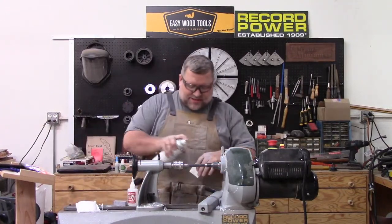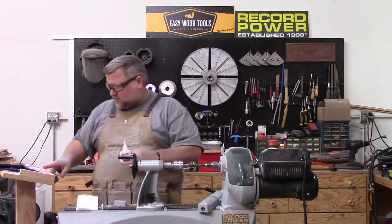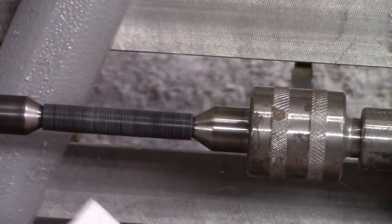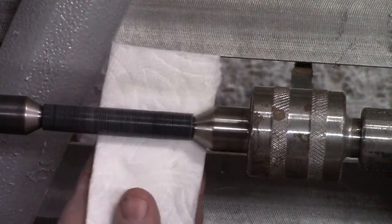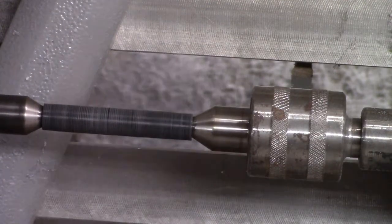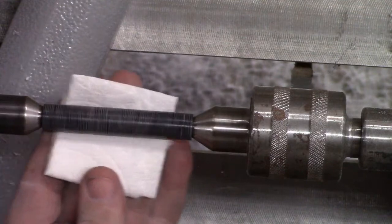Now that's already hard because I did have some residual accelerator. Oh, thank you, sir. But I can use this next part of the towel because I've only hardened the bottom part here. So I'm just going on and across. And that's it. When I'm done applying four or five coats, I like my CA to look like an orange peel feel. Not necessarily perfectly flat, because you just can't get it perfectly flat, but have that little tiny ripple. That way I know there's a buildup of it.